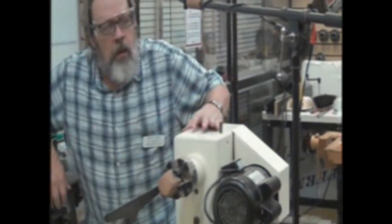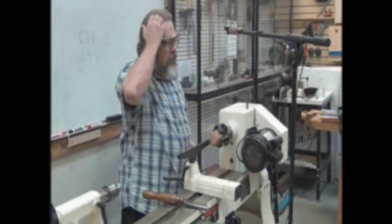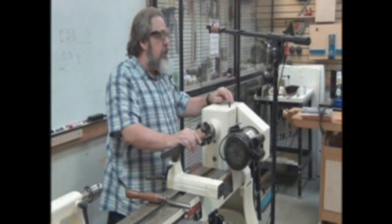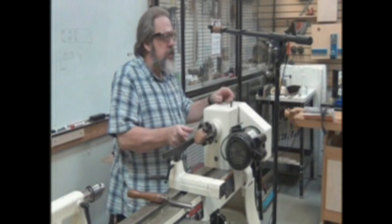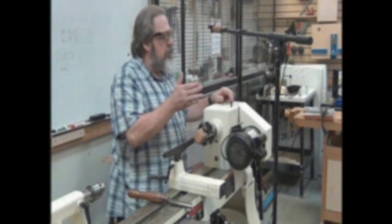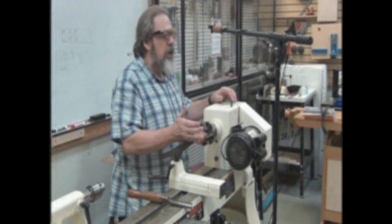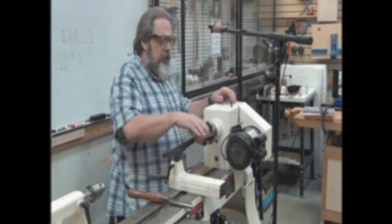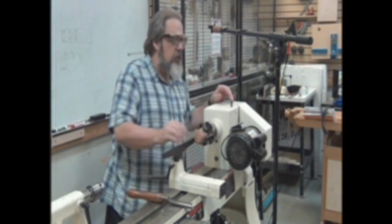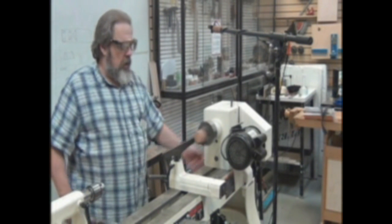They were really tight — maple and cherry, that's hard wood. There's a sequence to it, as there is for most things. If you start with a piece of cherry, you'll turn a series of tops to almost finish because you need to make a jam chuck to do the other side. Rather than making one part and then a jam chuck, it's better to do three in a row. This is what we had Marshall do last Friday at Safe Harbor — it's possible for a brand new turner.